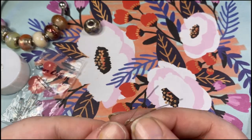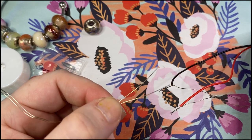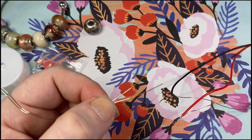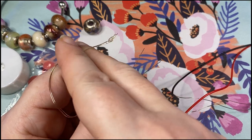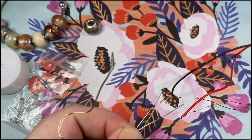Soon cools. So what we can do is bring our little battery pack back and turn it on, because we need to work out which is the positive and which is the negative. Unlike a normal bulb where one's longer than the other, we don't have that advantage. I'm going to curl this round so that you can see. And that's the good thing about these bulbs, you can literally curl them in any direction.